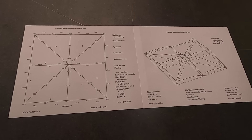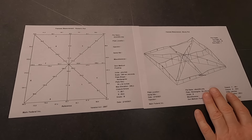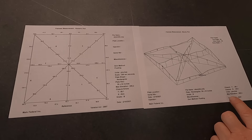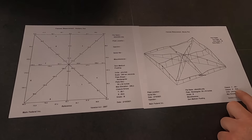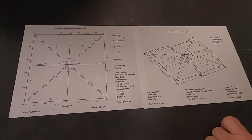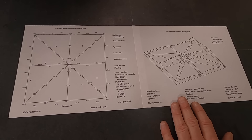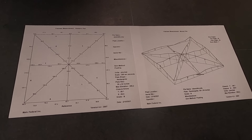We just printed out the results for Adam's plate and went over my reference book on grading. This is a neat 3D map of the Moody plot showing what we were just explaining. The closures are good — they're under 30 millionths — which tells me the data is relatively accurate. It's grading it as a B, but if you look here it's 206 millionths, or a little over two tenths, and actually the upper limit of an A plate is 200, so we're right on the upper limit. We still need to do some local flatness evaluation — that needs to meet 70 millionths local flatness total, high to low, in order to hit the A spec as well.